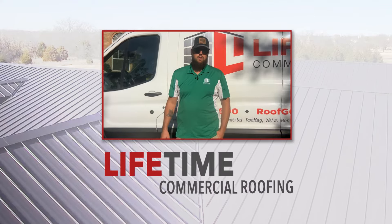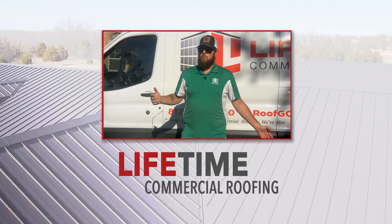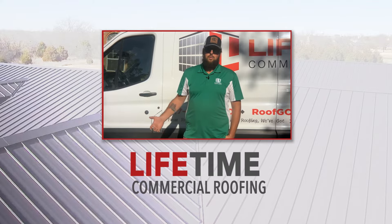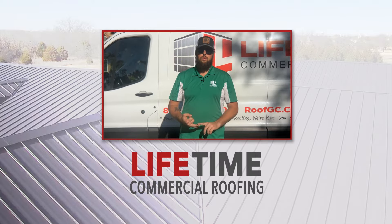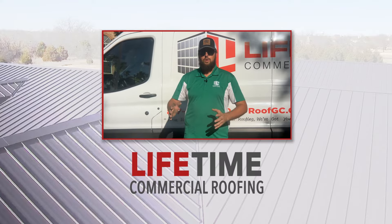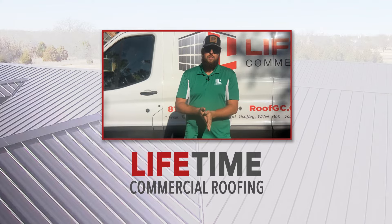Hey, I'm Ben with Lifetime Commercial Roofing. We're out here to do a job for Terminex to put some pest exclusion stuff on this man's roof, but we're gonna go over basic safety equipment for roofers. Roofing is pretty dangerous, and with the right safety equipment you really don't have much to worry about. We're gonna go over harnesses, using a rope, the pitch hopper, ladder, and the right order to do this stuff in — because we need to go up and measure the pitch of the roof to know how we're gonna set up our equipment or whether we need it at all. There's a lot to think about before you even get off the ladder.